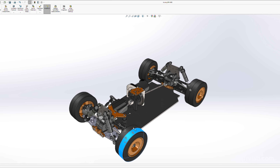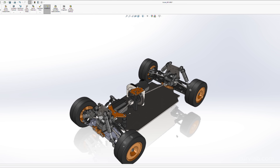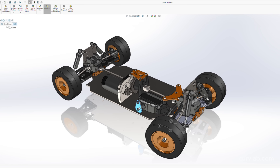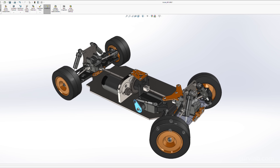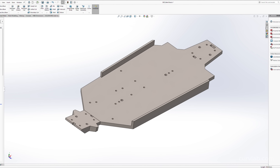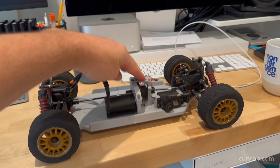As a baseline, I got the whole chassis built in CAD and started looking at the low-hanging fruit — the parts that would be easy to redesign to be 3D printable. I started with the main chassis plate. Since it's going to be 3D printed, it needed to be thickened quite a bit to be more structurally rigid. I also added upward-turned flanges that add strength to it just like an I-beam, and it passed the rigidity test.